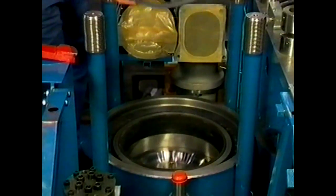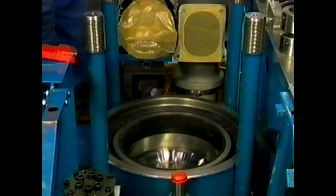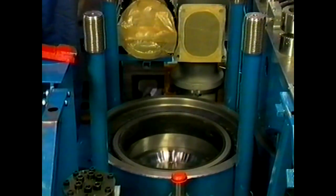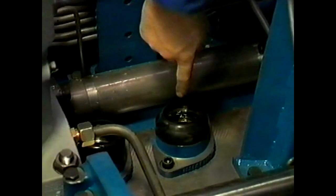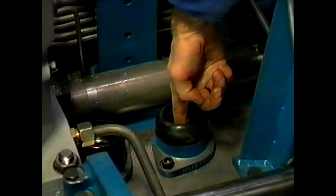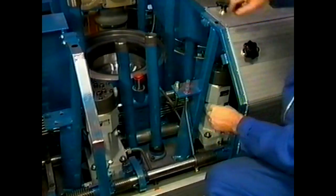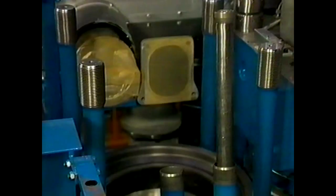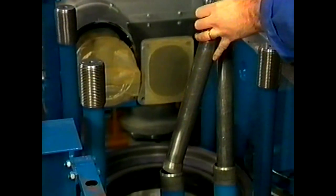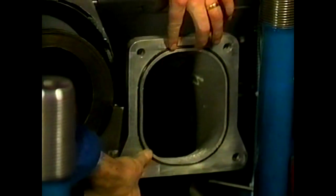When mounting a cylinder head, always use a new steel gas sealing ring. The gas sealing faces of both the cylinder liner and the cylinder head must be in good condition — otherwise, lap them slightly with a lapping ring. Clean the pushrod sealing rings thoroughly and grease them with the required silicone grease, which keeps the rubber in good condition. Subsequently place the pushrod protecting pipes. Check the pushrods for damage and mount them with the venting hole pointing upwards. Fit a new rubber sealing ring on the flange of the inlet air bend and grease it with the prescribed lubricant.